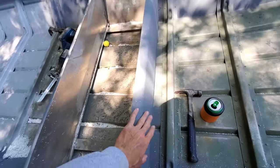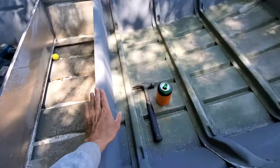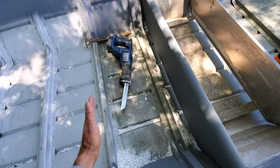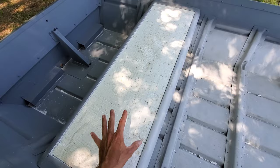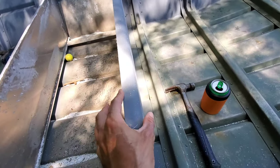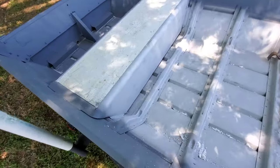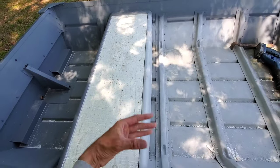Now in case you're wondering why I've left these sides the way they are - I'm going to tab in my framing for my front deck into this, reinforce the bottom, put a floor system in, frame off this and add another hatch in front. In the back we're actually going to put a live well inside this rear bench. I've left enough aluminum to attach my angled framing and tab back in - just enough of a little lip. When you do this, try to give yourself a lip so you can attach your framing back into something.